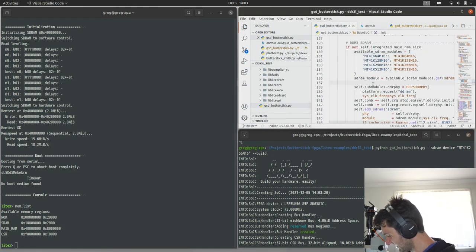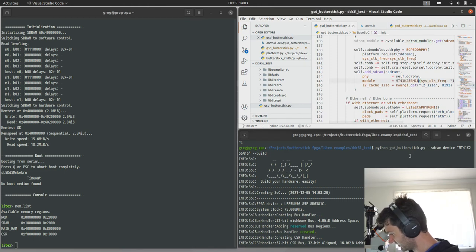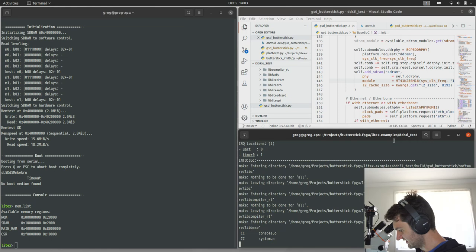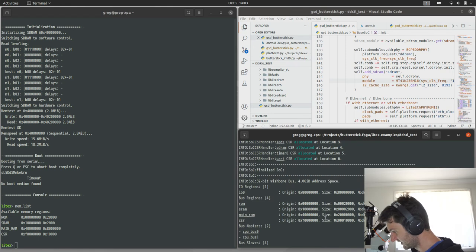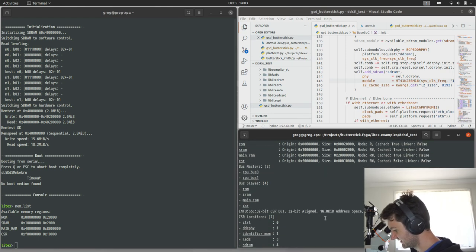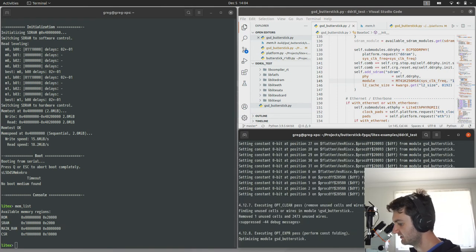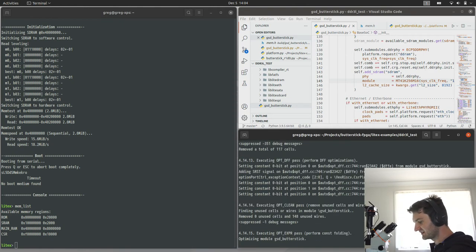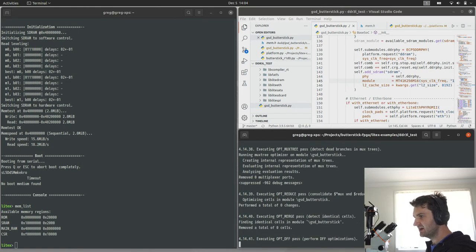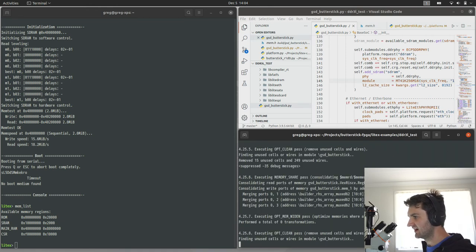Okay, there's probably something going on here that I've not worked out, but we can simply override the memory here. There we go. So for some reason, just the command line interface wasn't working. I need to work out why that is. But now the SoC is built with the correct amount of memory. The physical connections to the DRAM controller were all still there, but the SoC itself didn't know that it can address that much memory, but now it can.